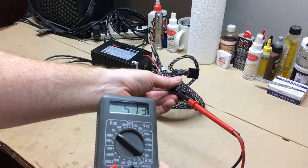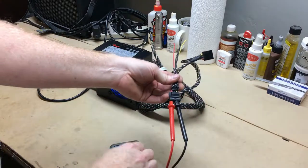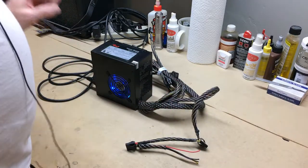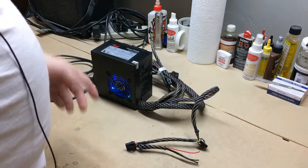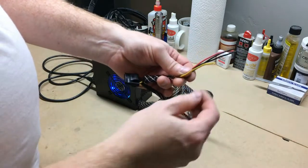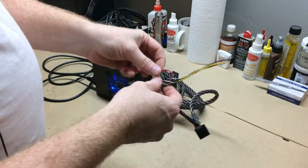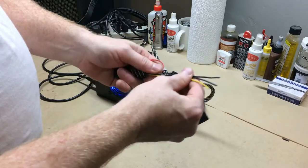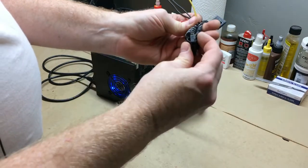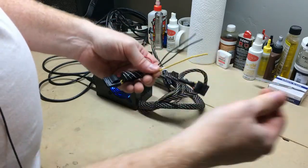If I bring the meter up you can see we've got 12 — actually 12.3 — volts. If I put the connector on the other side, that will be 5 volts, which we don't need, but just so you can see the power supply is functioning correctly — actually 5.13 volts right now. The yellow wire is 12 volts, black is ground, and the red wire is 5 volts. I've cut one of the connectors off so I can just use the 12-volt wires — I'm not going to reuse this in a computer anyway.